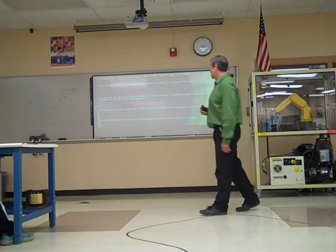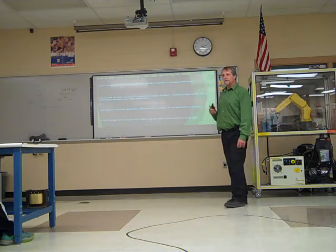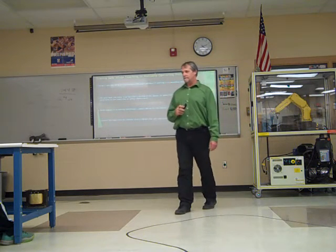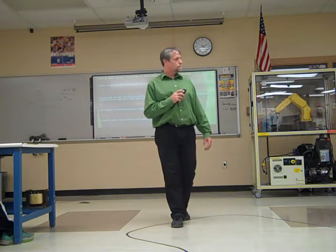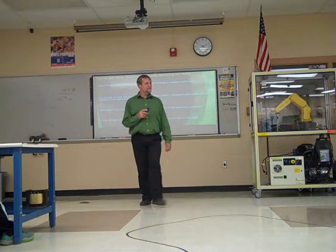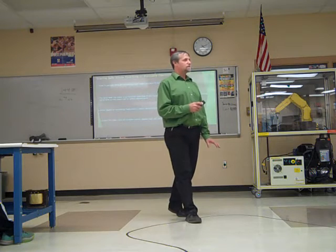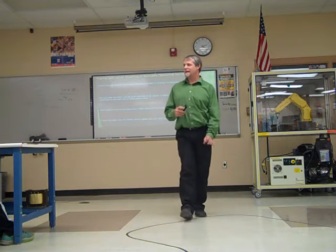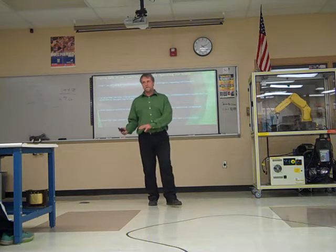Know if you're using an intrinsically safe teach pendant. What the heck is intrinsically safe? Any idea? Safe on the inside? Well, intrinsically safe has to do with whether it's sealed electrically, whether a spark inside the teach pendant could cause something to happen outside.